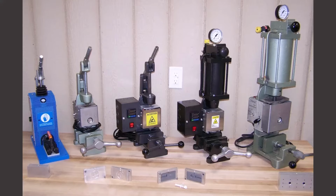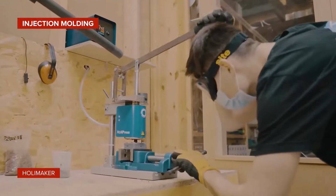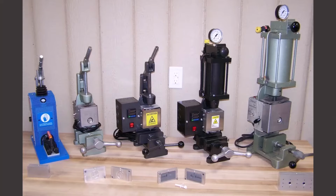Now, with Brascom's case, we looked at that medium-sized injection mold machine, but there are smaller variations that you can use, such as these benchtop injection mold machines here. They're a lot more cost effective. The one thing I'll draw your attention to is the three on the left here. Those are manual injection molders, which use a lever process, and the two on the right are pneumatic. But you can see that these are smaller. They don't really allow large molds to be fitted in there.